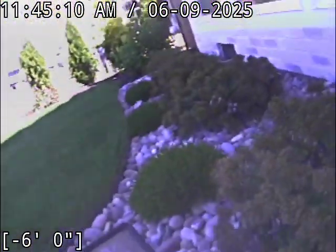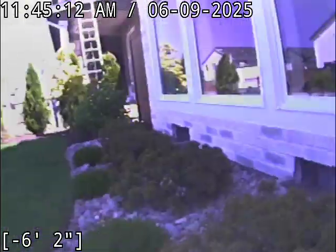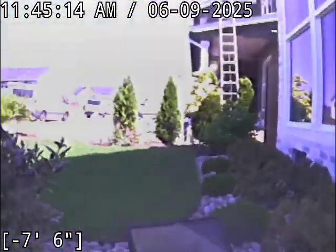So if you do any cleaning on the line here, luckily all of it can be done from the exterior. You don't have to mess with the interior pipe. As this line currently sits, we have good flow to the main. So it wouldn't hurt to clean the line, but it's not at a point where that grease would be causing blockages all on its own. It would mostly contribute to a blockage if something already large or abusive was going down the line, either a whole bunch of balls of toilet paper or something improper like wipes, paper towels, things like that.